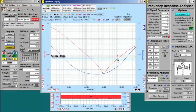Now we will try improving this by putting in parallel a Wurth 330 microfarad polymer electrolytic capacitor. Before we make the next capture, let's record the current impedance and Resr. We'll do this using the references. So we are add ref for channel A and add ref for channel B. Now I fixed a 330 microfarad Wurth polymer electrolytic capacitor to the board, and we'll start the sweep.